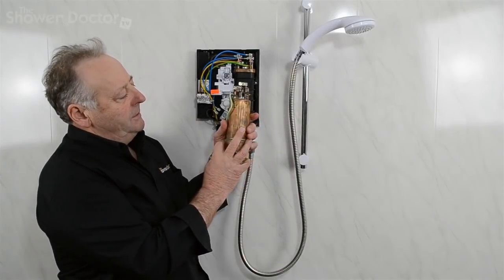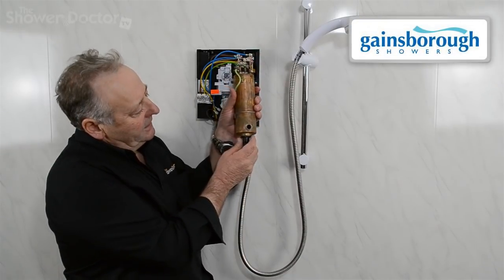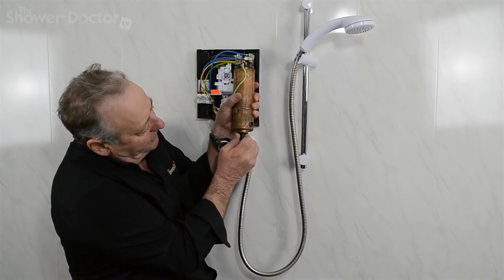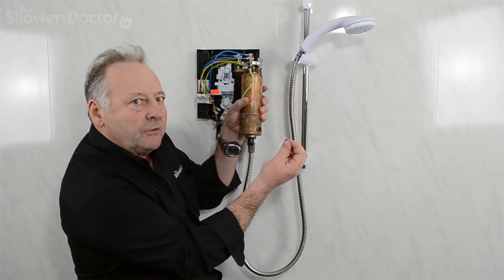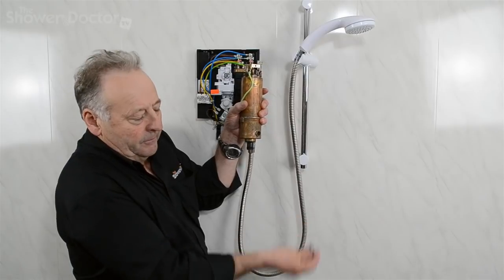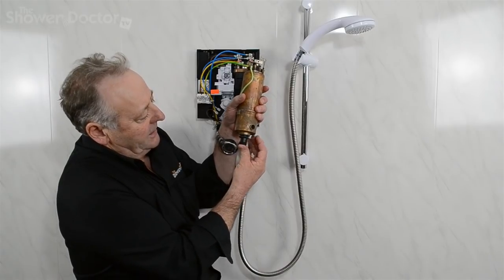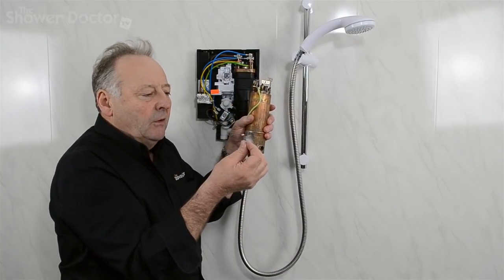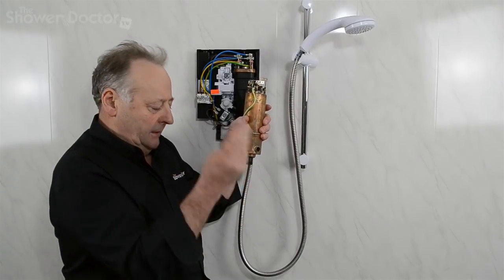Now to have a quick look at the Gainsborough pressure relief device. It's slightly different to most of them — basically when the pressure builds up inside a Gainsborough shower, it blows the bottom of the shower out. This is just pushed in with a rubber O-ring, but what holds it in place is a metal clip. This is a fairly soft piece of metal, so when there's any pressure inside the shower, the pressure pushes down, bends that bit of metal, and the outlet pipe pops out the bottom. You can try to re-bend this bit of metal back into shape, but similar to the Myra, once it's bent, it never seems to work properly after that. You really need a new outlet pipe and a new metal plate.